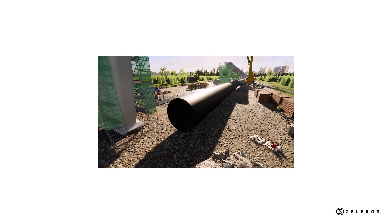Tubes are made of a composite material that consists of three layers. The inner and outer layers are made of a material such as fibre-reinforced plastic or a fibre-metal laminate, giving the tube the structural resistance. The core layer in between is made of a polymeric or cement-based foam that provides thermal and acoustic isolation properties to the tube.